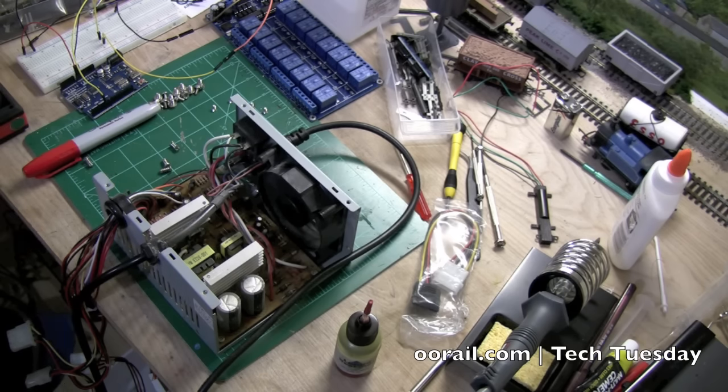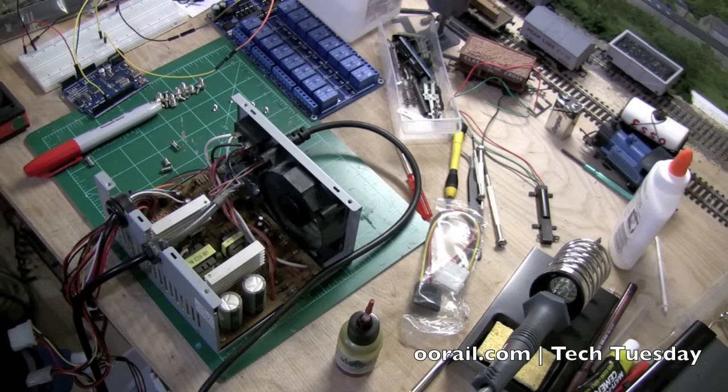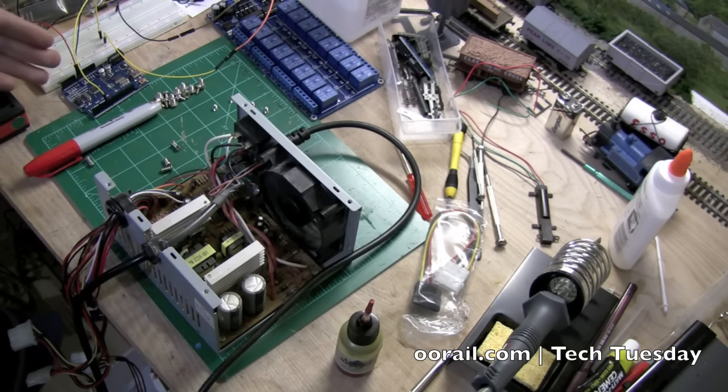I looked around and first I thought maybe I could use some of the train controllers. The H&M controllers are supposed to have a 12 volt DC side socket. When I took the multimeter to these and hooked it up, I discovered the H&M controllers were outputting about 16 volts DC. Some of the Bachmann controllers were outputting between 16 and 20 volt DC, and some were doing very weird things altogether. That's really not good for digital electronics like the Arduino or these relay boards — they really need a stable power source.